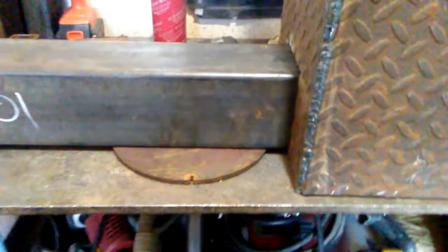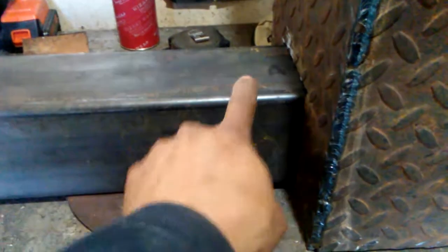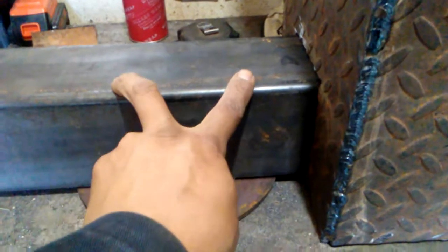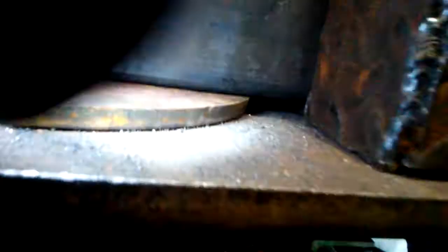Okay, here's the dry fit. I'm going to make it 2 inches from here to there, and cut out the tubing for there with a feed tube, and then cut it off right there. That way the feed tube comes up, and I don't know if you can see it down there. It fits in there real nice, so I'm going to weld that on there to that bottom plate just like that, on that round plate, and it's sticking up 1/4 inch, and that other round bottom one will be coming out right there. So that's just a dry fit.